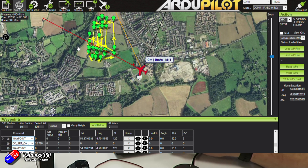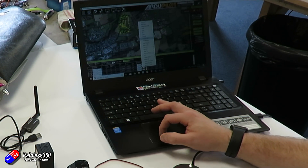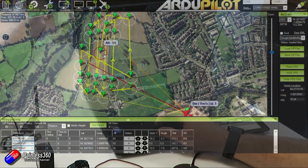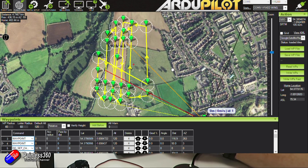To load this mission onto the drone, with the flight controller connected by USB or over a telemetry radio, I can click write waypoints. Those waypoints have now been written to the Pixhawk. If I want to check that it has worked, I can right-click, delete this mission, and then read the waypoints back. It prompts you to reset the home coordinates — I'll accept. All those waypoints have now been pulled back from the Pixhawk, so I know they're saved. There are a couple of tricks you can do if you've planned complex missions — you can save this mission path to the desktop as a waypoint file, allowing you to save and share it.